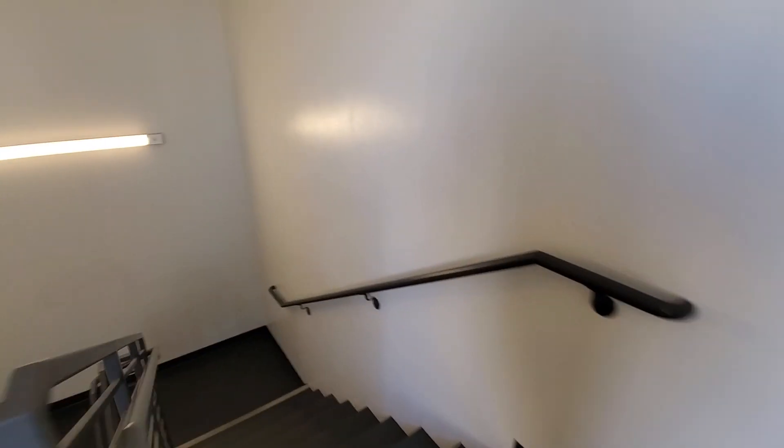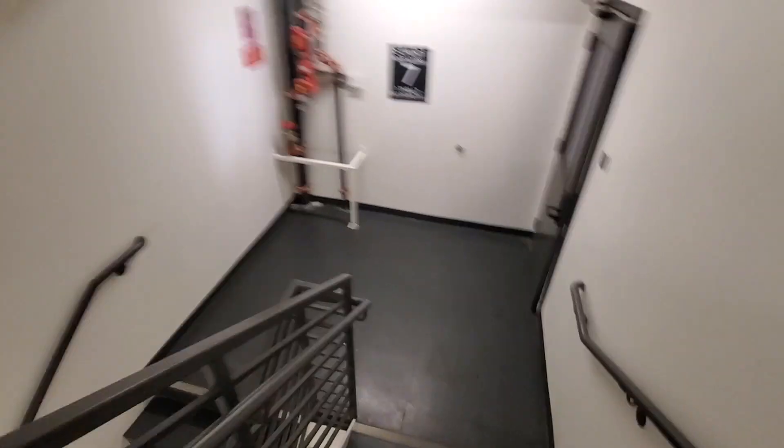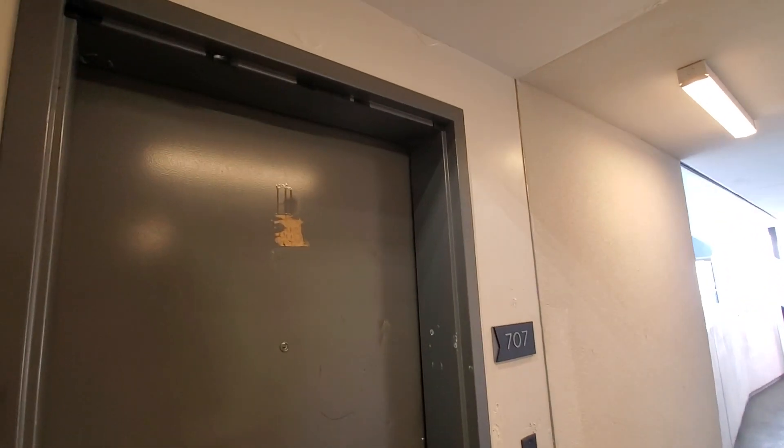You've got to turn the boilers off. The longest part of this job is going to be bleeding all the air out of those lines that go to the boilers. Okay, let me get situated — draining the building down, or the top floor I should say.